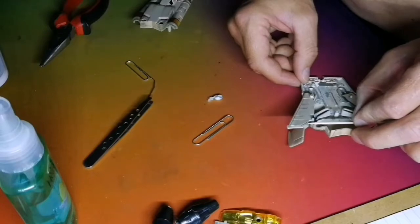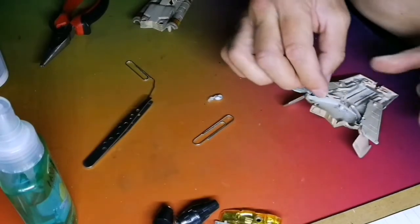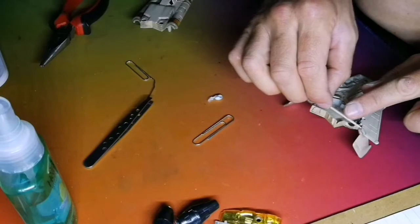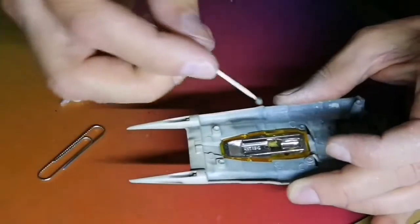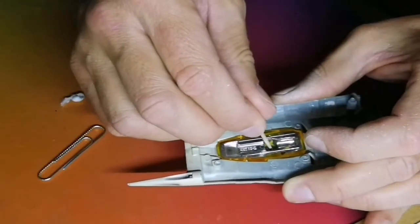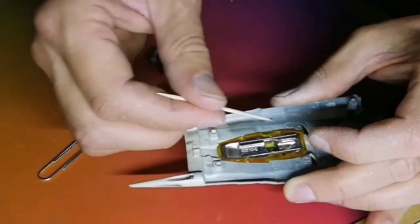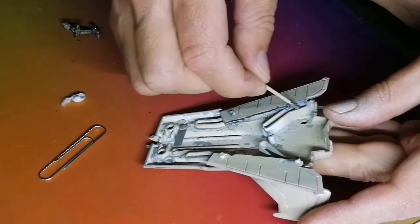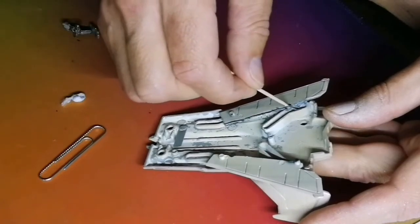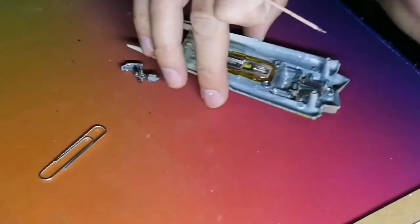Okay, here I am fitting the wings that I actually made from resin casts. What I did was I took the wings on the other unit that are pretty perfect. So I used a silicone mold to do a negative of these, and then once that is done I put resin inside there and I've got 2 new wings. I didn't do the complete wings, I just did the section so that I can fasten them with glue so that they stick out the sides in the correct manner.